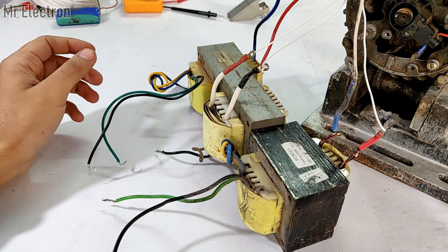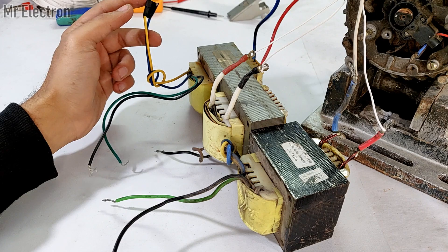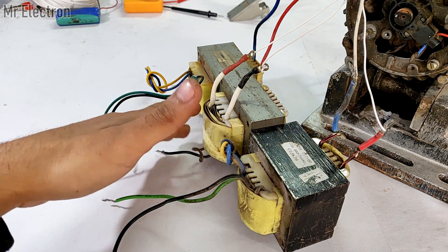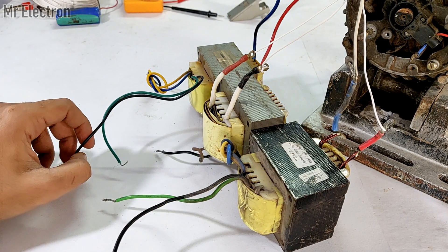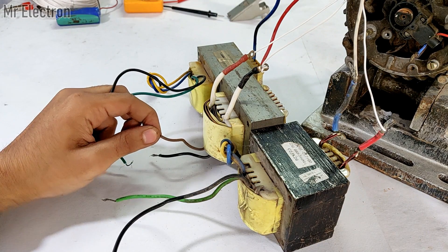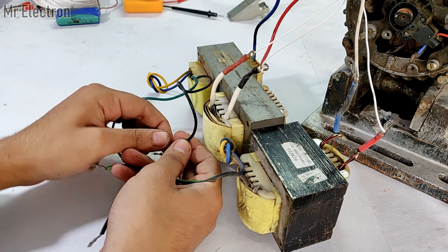The resistance check has completed and I have isolated the wires I'm not going to use on the high voltage side of the transformers. The remaining six wires of all three transformers will be connected in series. I will connect them in series first and see what happens — if the results are not good I will change the configuration.